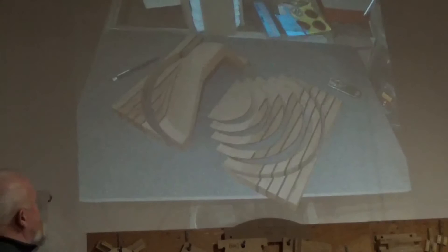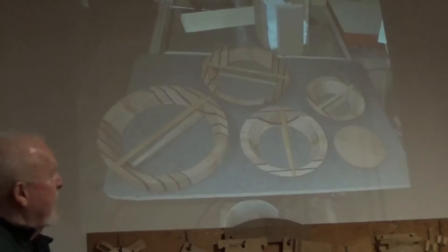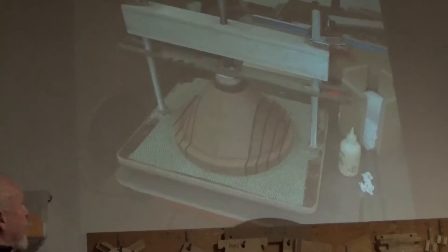Now I'm cutting it on my bandsaw. Just because of the way I glued it up, you can see the design starting to take shape. Now I've got to glue those rings together — these are the really big rubber bands you can buy from Rockler. I have a drum sander so I was able to run them through it and flatten them all. You've got to be real careful not to take too much off because all these lines have a tendency to start not lining up. Because I was getting paid $600 for this bowl, I decided I better make it as good as I could.